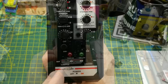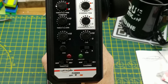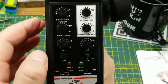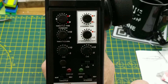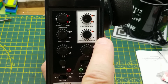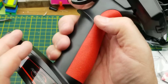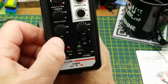The controller has a forward/backwards trigger and a potentiometer for speed control — it looks like a steering wheel. On top there's a power LED, low-battery LED, throttle normal/reverse, steering normal/reverse, throttle trim to offset the center position, steering dual rate, and EPA on throttle. It mentions channel five and six even though it called itself a four-channel radio.